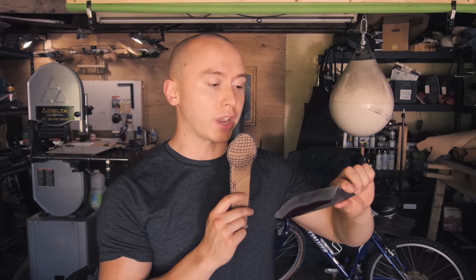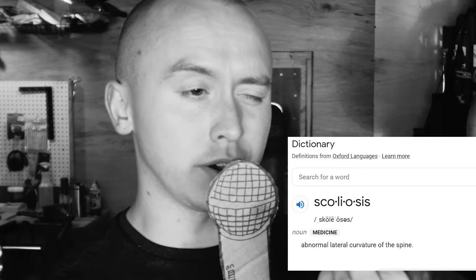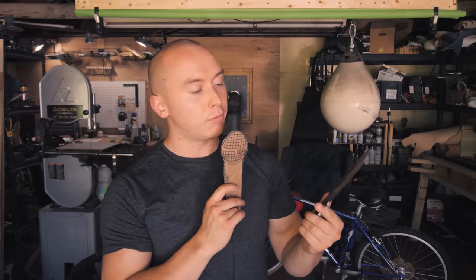About 40 minutes of super careful grinding, dunking, and checking later, it becomes painfully apparent: I have never struggled this hard to put a straight bevel on a knife. A terrifying thought pops into my head — what if the Damascus blank I bought on Amazon Prime was not perfectly flat ground before they sent it to me? I look down the spine — scoliosis. Absolute scoliosis. I'm left with two options: restart from the beginning, or attempt to do the flat grinding while the bevel is pretty much already finished. That basically never works — you always end up with really bad horizontal scuff marks on the bevel. But what if? Just think of the time I could save. Let's give it a shot.